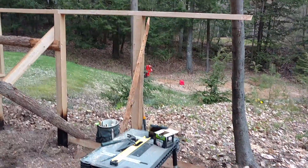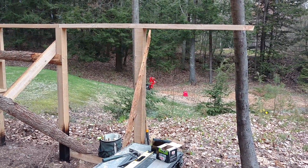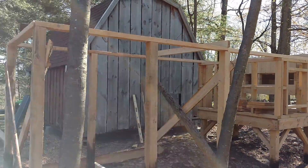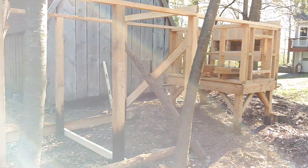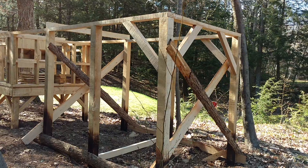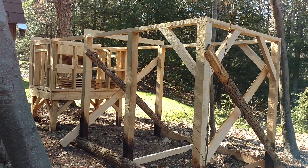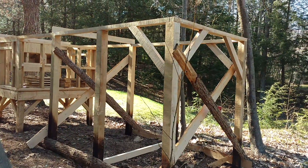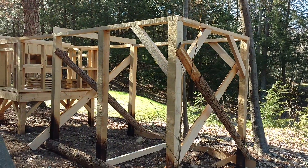It's starting to rain so I'll be back. I got the last of the posts up for the outdoor run - I'll have a 6x12 outdoor run, and there's the coop at that end. I'll get the big braces up on the outside corners, and some of the collar ties on. I think I can start pulling the temporary diagonals off, and it should be stiff enough at that point.